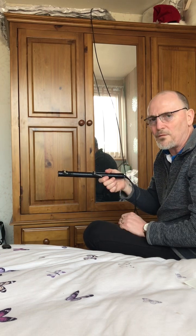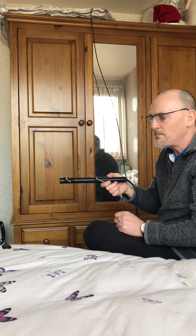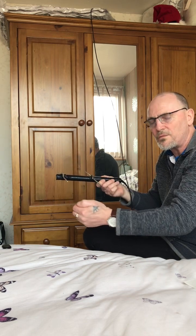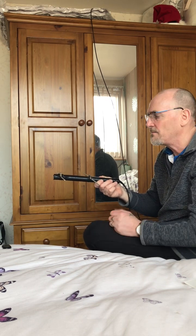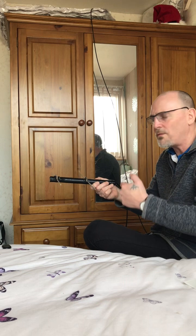If we tipped it that way, we would have 20 to 25% signal loss, because it's polarised differently, between the polarisation between that and that. If we try to talk to a station of the opposite polarity, we will have losses, 25%, in extreme cases 30%. Well, we don't want to do that. So we have to decide what our target interest in the hobby is.